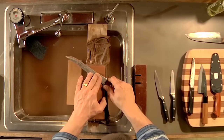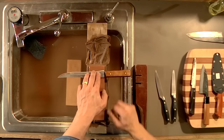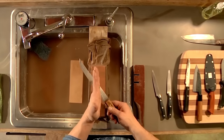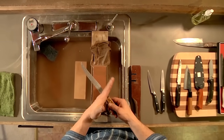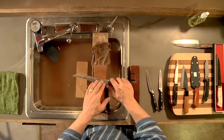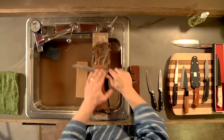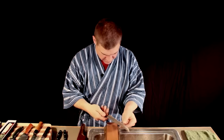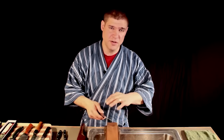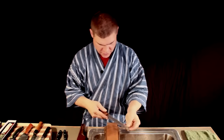When I'm grinding here, I'm not able to sharpen this last corner unless I rock that blade 90 degrees. And that causes some problems because now I'm going to have scratches in this blade that go this way, this way, this way, but towards here they're going to start getting all cloudy and wavy because I'm grinding at different angles. Now, is that going to be a big problem for most people? Generally not. However, visually it'll impair your blade just a little bit, especially when you get to the 7th stage where you're using that 6,000 grit stone to polish out all of those scratches that you put in with your rougher stone.